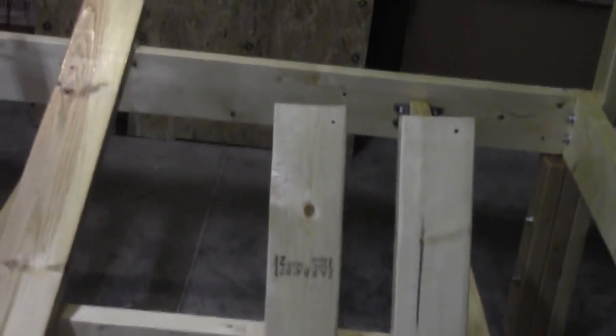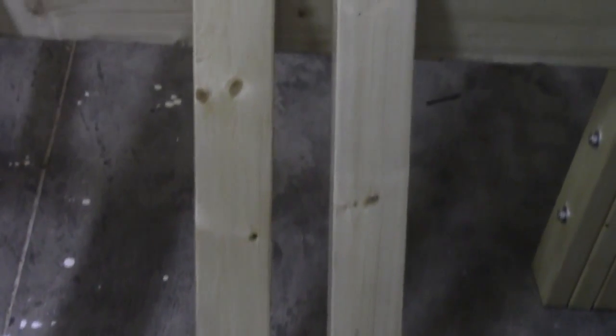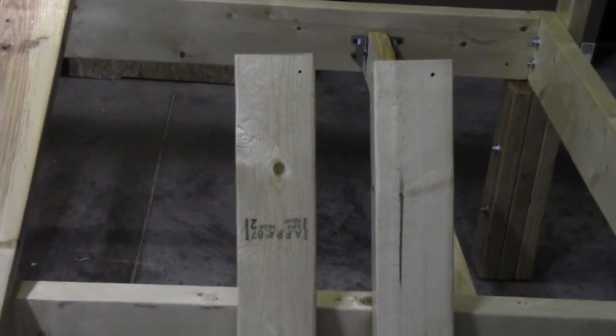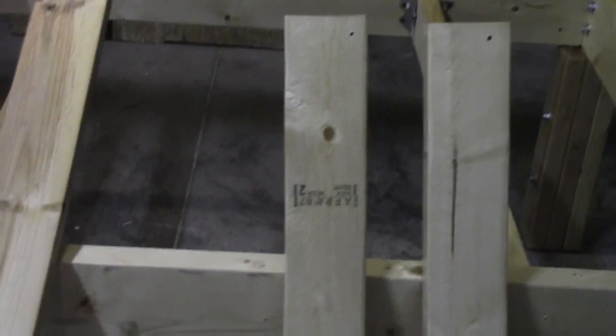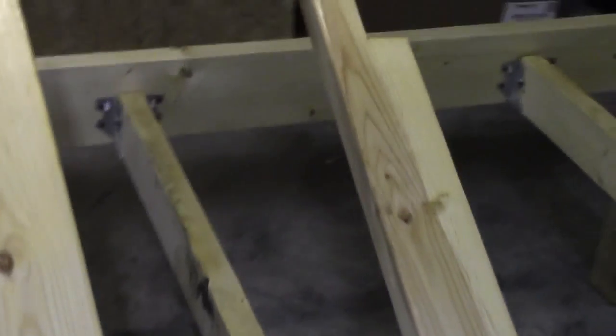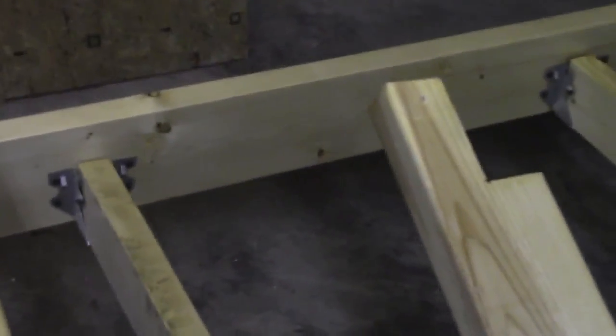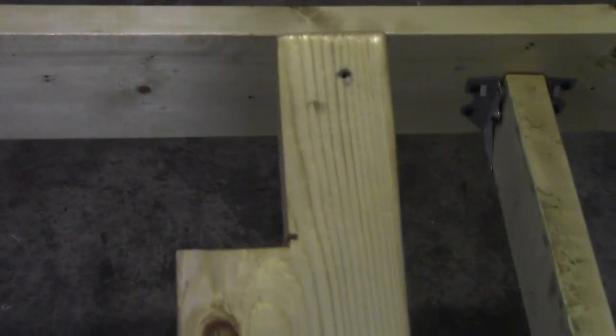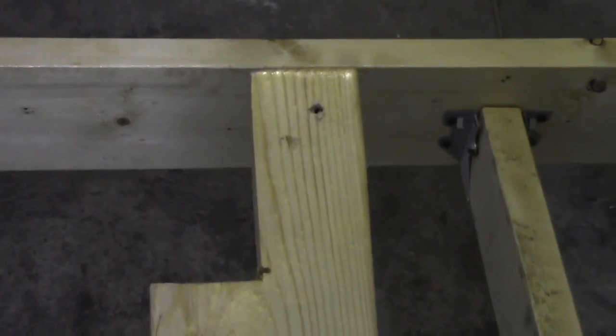Here are the pieces of wood that we're going to use to build the frame at the top that secures the mosquito screen. You've got the two short pieces of 2x4 which look the same, or actually are the same length as the ones we used underneath the bed box. And then we have longer pieces that you'll recognize because at the end of each they have a notch cut out right there, and I will show you exactly what that notch will do in just a second.